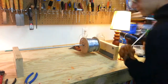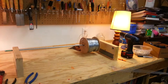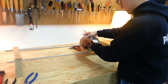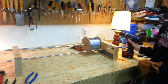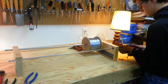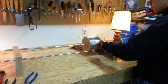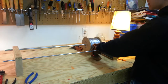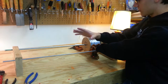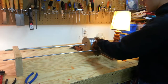You'll have your pre-drilled hole and what you're going to do is just stick your wire through and spin it to make a coil. I like to leave a little bend in it while I'm getting situated. With this setup, I like to go counterclockwise — you can go either way, it doesn't really matter. Start slow first. I'm pushing my hand down to keep it tight so that it makes a tight ring on the rod. If you let it just go, it kind of doesn't work and makes a little mess. Keep it tight.